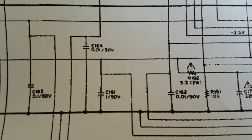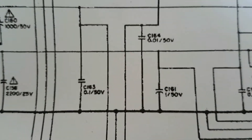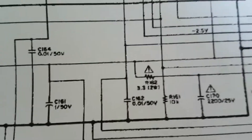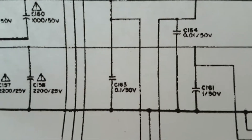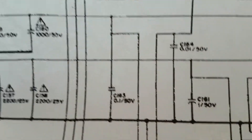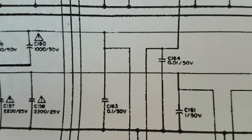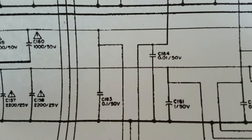I've been checking some of the ceramic capacitors. The 10 microfarad ones were reading fine, though they took a little bit of time to charge up to their capacitance. Most particularly, the 100 nanofarad ceramic capacitor was taking quite some time to get up to 100 nanofarads — it was starting off around 70-something and just slowly building up its capacitance. So I'll replace that with a polyester capacitor, which gives immediate capacitance close to 100 nanofarads.